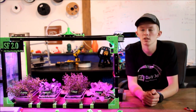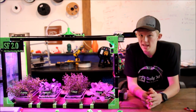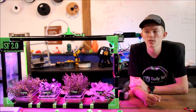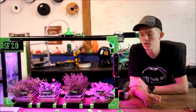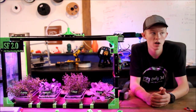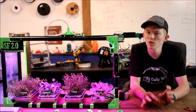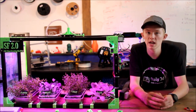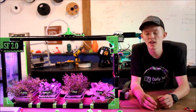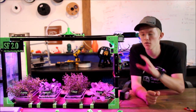So once I got that part done, I started working on the coding, because that was the scariest part for me. So to start off with the coding, I would just look up Arduino code for L298N, and I would download an example code, and then I would mess around with it, tweak parts of it to see how that affected the actual stepper motor being driven, and then I would put together little codes and I would save them separately for all the parts.